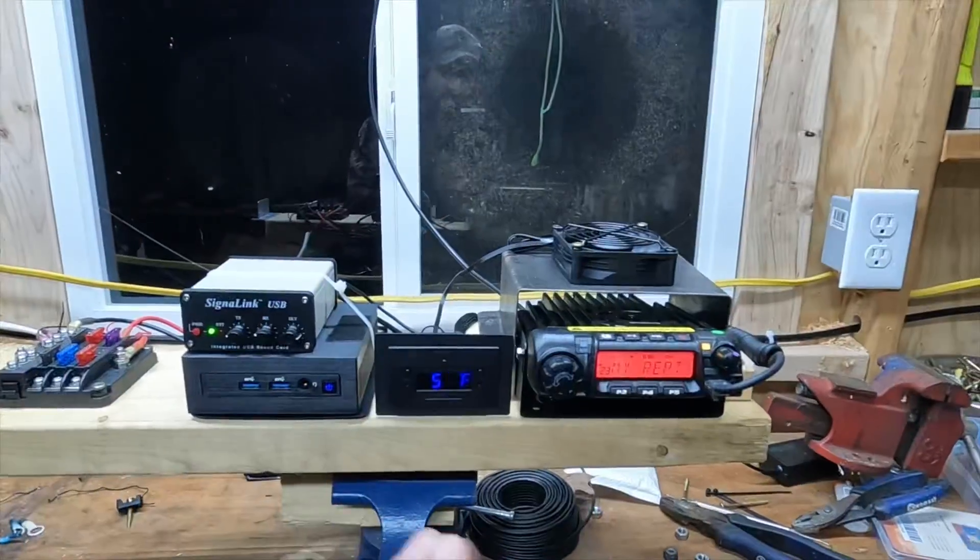You can put this on channel 9, channel 8, 7, 15, 16, 22 — grab your handheld and talk straight to this radio and it'll go onto Zello. You don't need a repeater, so don't think you have to have one. Just be aware that if somebody is on an FRS radio, they could technically talk to this system and transmit on GMRS Live or wherever you've got your node connected via the internet. You can't do a repeater frequency with just this radio. If you liked the video, hit that like button, subscribe if you're new, and as always — take someone outdoors.